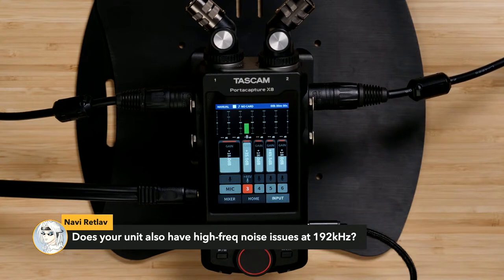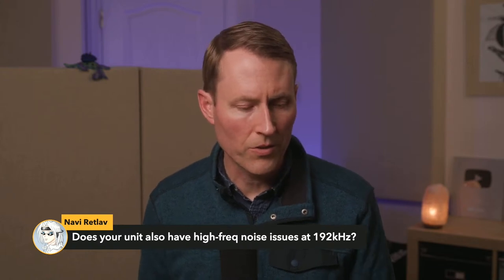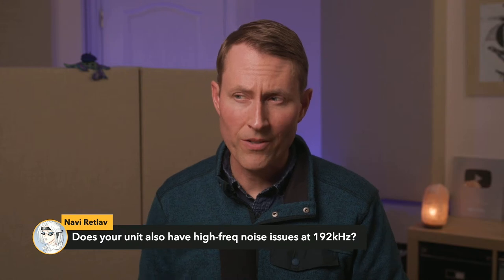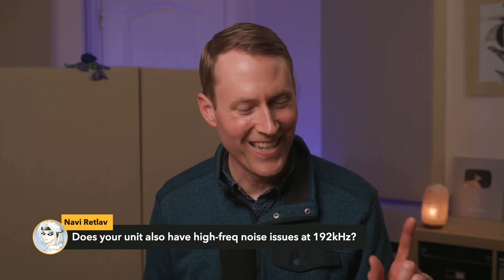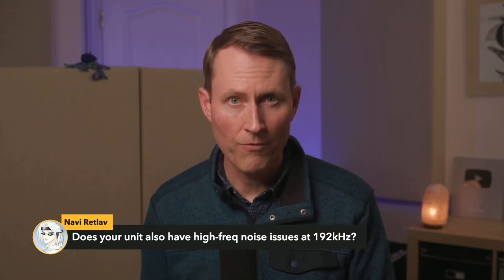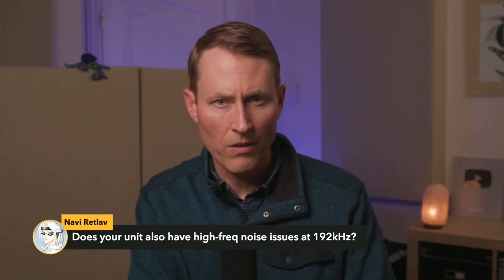So let's go to the main camera, actually. The recorder does support sample rates up to 192 kilohertz, just for recording, in fact. As an audio interface, from what I can tell, and again, I have the 1.00 firmware, there actually is a 1.03 firmware. I can't do the firmware update until I get that micro SD card. But on this 1.00 firmware, it does not appear to support sample rates other than 48 kilohertz or 44.1 kilohertz when you're using it in audio interface mode. Just FYI.